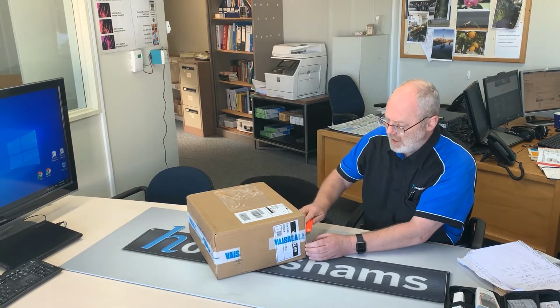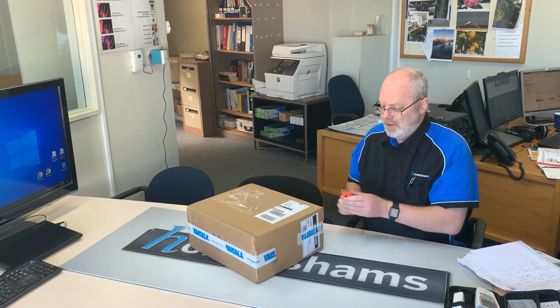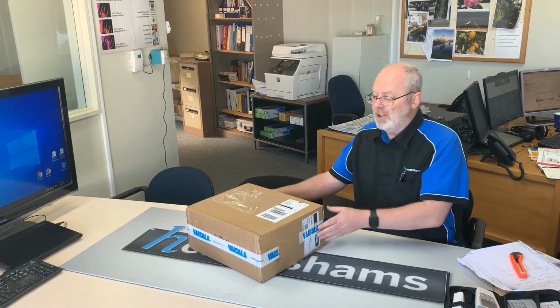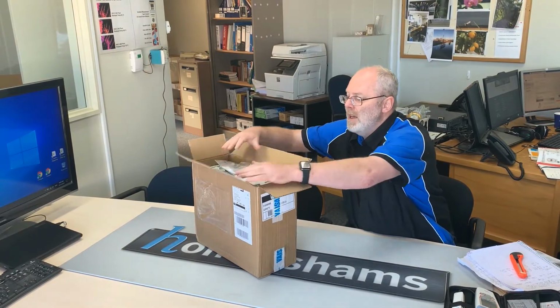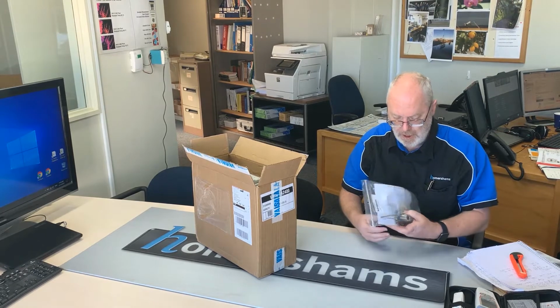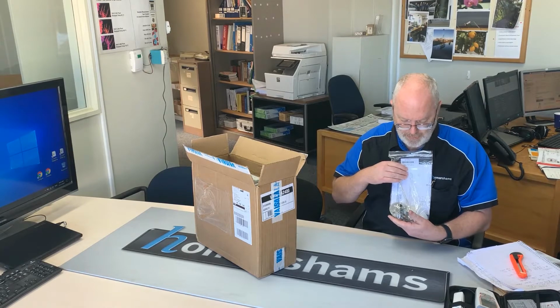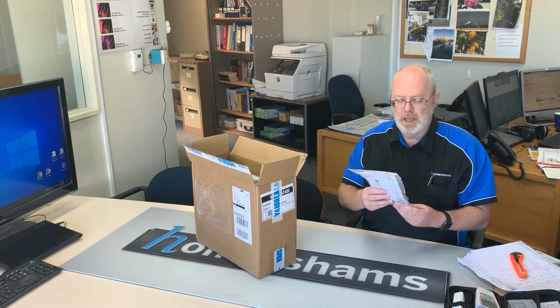So this is the HM70. Its claim to fame is multiple. One is that it's designed to be able to calibrate other units. Its accuracy is such that you can use it in a factory. If you have fixed in situ devices, you can wander around with this one and do the measurements. Now in this case, my customer is mounting it through a wall. He's in a non-breathable atmosphere, so he's using a kit to put the probe through the wall to measure the humidity.